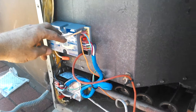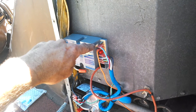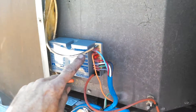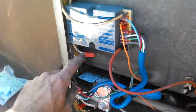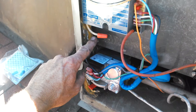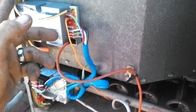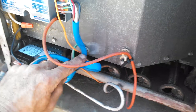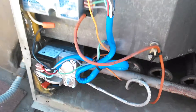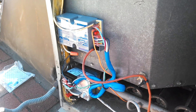So instead of this hooking to the gas valve like before, this is your thermostat power wire coming straight in at the top of your ignition module. And then this is just your common wire — your 24 volts. You just hook up the terminals almost the way it says in the instructions. And you have to have a ground wire, which I installed right here. I've started it up a few times and it runs perfect.